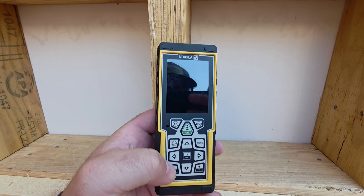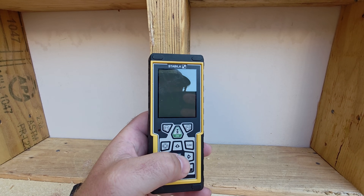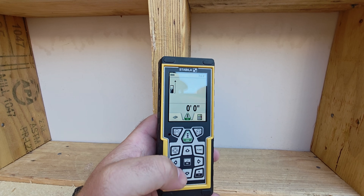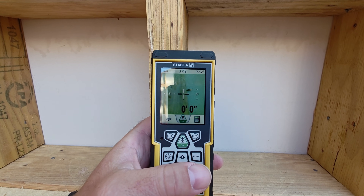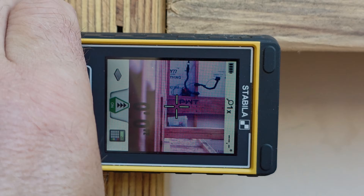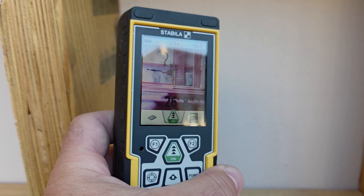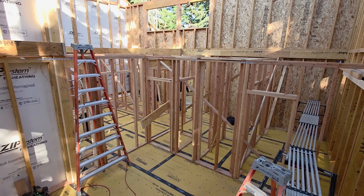I don't really use laser distance tools much. I've got this one from Stabila — we tried them out way back in 2007 and it was hard for us to see the dot over long distances. Kyle Stumpenhorst told me I need to be using this, so I'm going to follow his advice. What's great about this one is it has a camera built into it. So now if I shoot that right across — look at that — it is right at the PWT ledger on the other end. Tilting it and getting rid of the glare: 26 foot eight and three quarters. You also see exactly where I shot that.